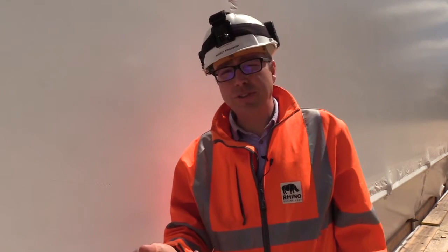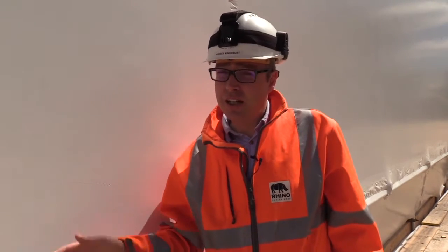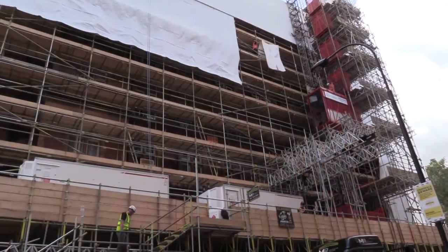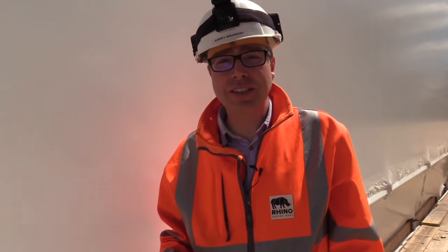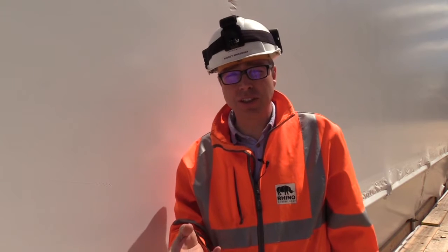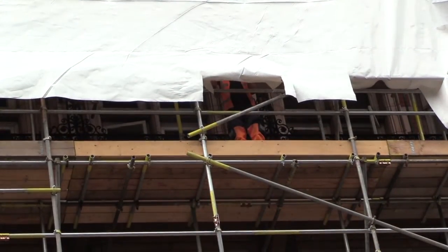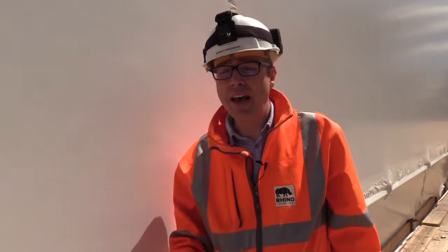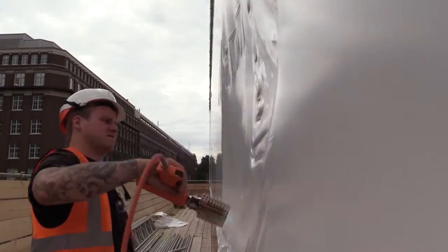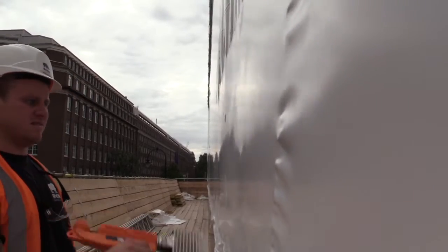Going into a little bit more detail, traditional scaffold sheeting products tend to be fitted lift by lift around the scaffolding, whereas scaffold shrink wrap tends to be fitted with no real limit to the drop — for an exterior scaffolding we would generally drop around six metres before fixing it back to the scaffolding. The way shrink wrap sheeting is fixed back is another major difference. Traditional sheeting was fixed using bungees, whereas shrink wrap sheeting is wrapped around a scaffolding tube and then heat welded back onto itself. Because there are no bungees that can stretch and lose their elasticity over time, that doesn't happen with shrink wrap sheeting, which is one reason why it tends to be used in very exposed situations like bridges — anywhere where the sheeting detaching could have really serious consequences.